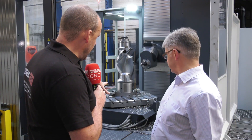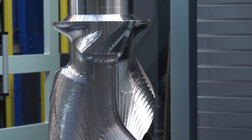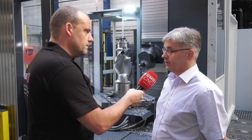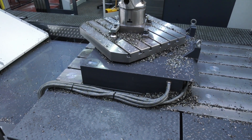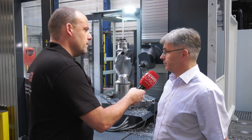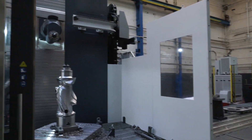You've got here an additional axis. At the moment it is seated on the bed of the machine, but can this be tipped up into a 90-degree angle? Yes, that's another deviation from the standard Norma L — the Norma L rotary tables are integrated. We've made a conscious decision to make this a horizontal/vertical rotary table. We plan to take out the center partition on the pendulum machining and use the full length of the bed to machine shaft work using the rotary axis in a vertical position.